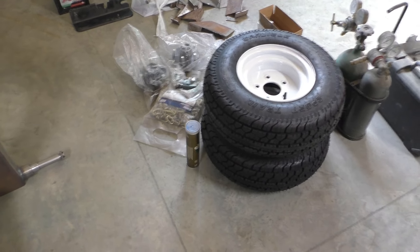So now I'm going to start assembling the pieces that I cut out into box sections, and we'll get back once those are put together. Okay, so we got all the pieces of channel welded together into tubes and cut into pieces for the arch.